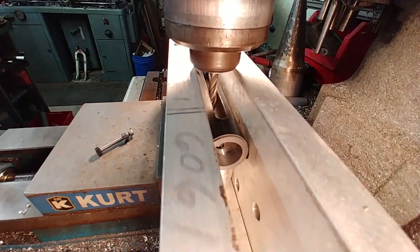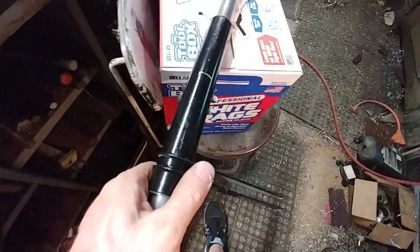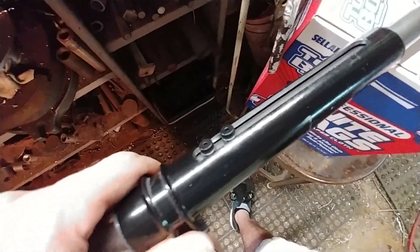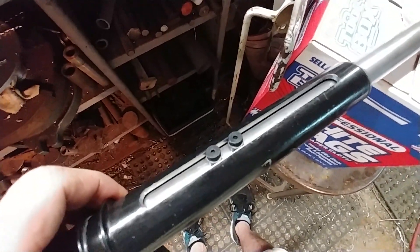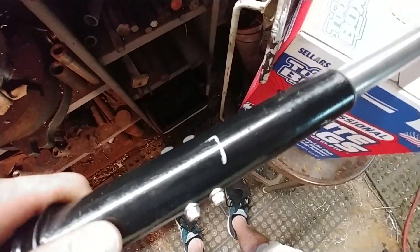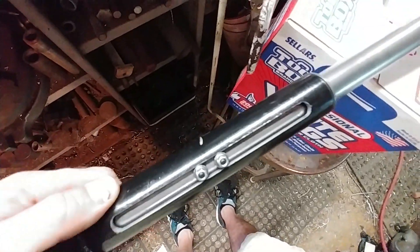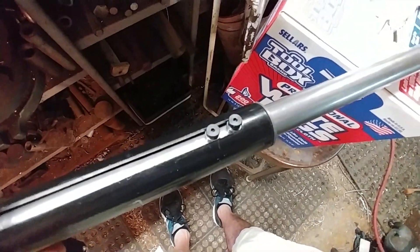Hopefully that will tighten everything back up again. I had to go up to Brit's and do that on his Bridgeport. This is one of them now with the new bearings in there — sort of a switch over to metric, so 5mm bolts with 10mm bearings, looking pretty good. But I still have to do some work there because when the Bridgeport runs down it doesn't create the smoothest surface, so I still have to do some hand work with filing and sanding on those edges.